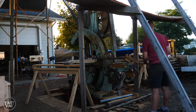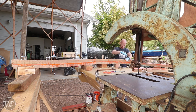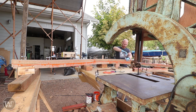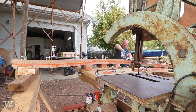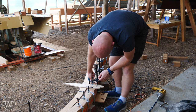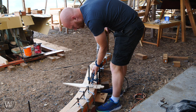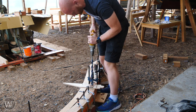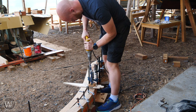Once we have these cut up, we can get to gluing them up — and we're not actually going to use glue, we're going to use a sealing paint. This paint seals everything between the gaps and allows a little bit of movement as the ship flexes through use and expansion and contraction. Once they've been clamped up, we bore holes through and put pegs through — the pegs are what actually hold these frames together. They're called trunnels or tree nails.